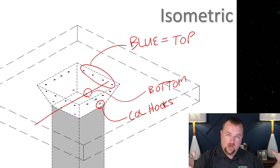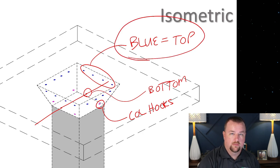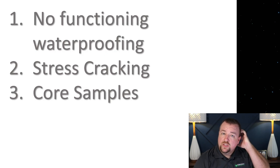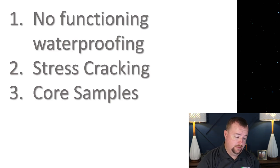The thing I'm contending is that if all this rebar was here and working as intended, we would end up with large chunks of concrete on top of these columns when the slab came down at the pool deck. But I have reason to believe we didn't get any contribution from the top rebar. There are a couple of reasons why. One: we know the deck had no functioning waterproofing. We also know from my garage walkthrough video that the underside of the slab was exhibiting stress cracks, indicative of a slab under distress due to overloading or lack of capacity.